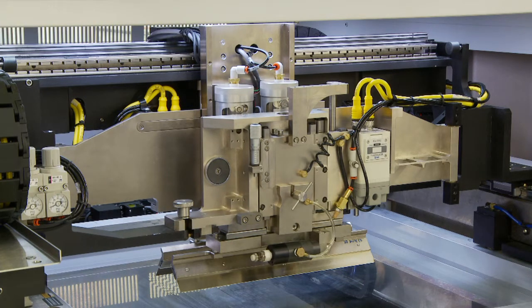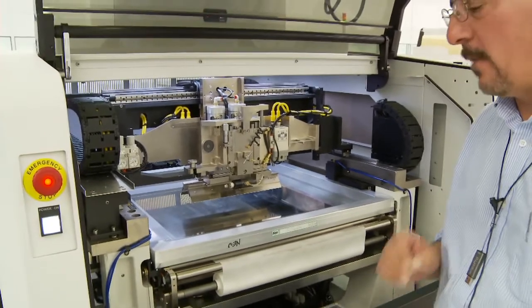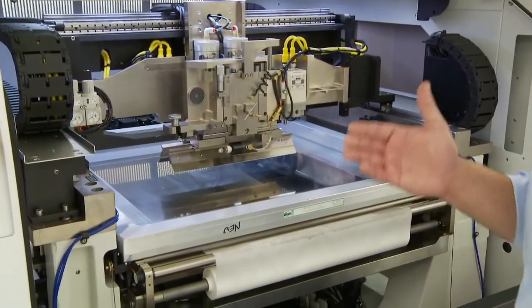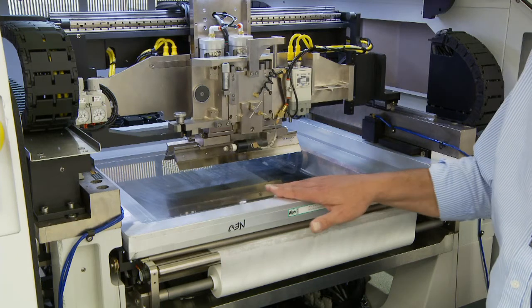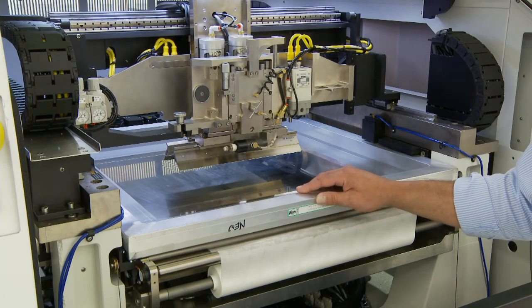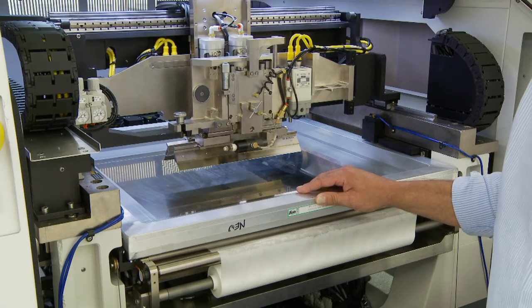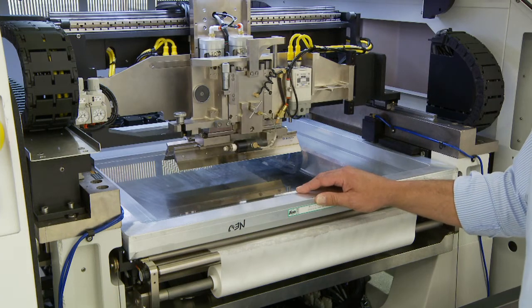We boast on X, Y, and theta CP and CPKs of greater than three, whereas the competition only boasts somewhere in the order of two. How can we do all this and offer our clients speed and accuracy? It's very simple — this machine is one of the heaviest printers, if not the heaviest printer, on the world market today. She comes in at just a little bit over 3,400 pounds. It simply comes down to issues of stability and accuracy. How can we maintain high speed and accuracy? You start with a rigid base platform, and that's exactly what we've done.